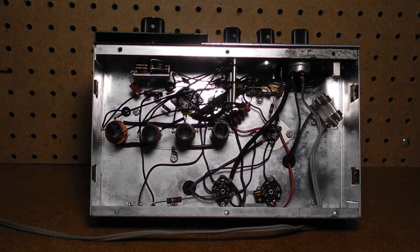This variable capacitor is the fine tuning control. A transformer isolates the circuitry from ground, making it safer than many other low-end radios. The tube filaments are still in series though, so if the filament is open on any tube, none of them will light.